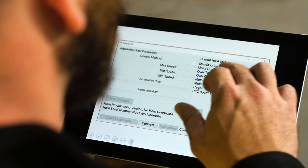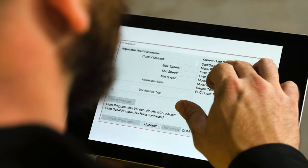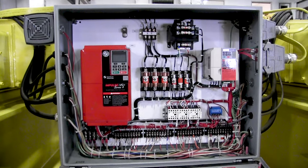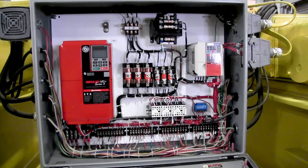Modern-style radio controls also offer diagnostic and monitoring off-site or on-site. Crane operators and production personnel can now use mobile devices, tablets, workstation computers, or an operator's belly box to view real-time diagnostic data. With the introduction of variable frequency drives, microprocessors now control all components of the drive system and provide smoother acceleration and deceleration curves.